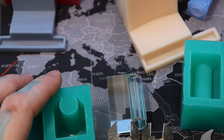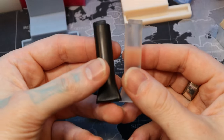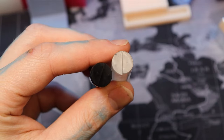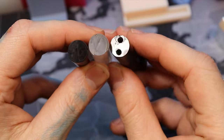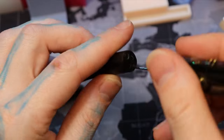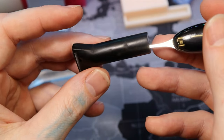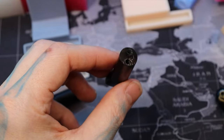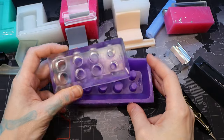Another quick thing — here's what's possible and what's not. These are SFIC actuators. I 3D printed this one, and you can see the mold copied it really well. However, here's another type of SFIC actuator I wanted to make a mold of but it's too deep — these holes are far too deep, so the silicone going down into them wouldn't pull out easily and could get stuck and break off. So that's not quite possible to mold, and I skipped it.